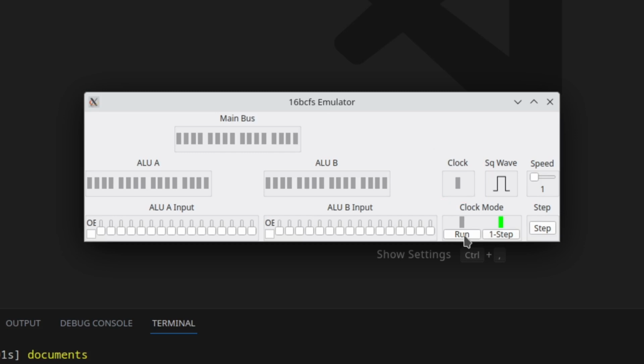And so what I'm going to do is create a 74LS or HC74 IC, and that has two latches on it. I need to latch both the run condition, so this LED here, and the single step condition, or this LED here. Now this is implemented as an SR latch, and so I will effectively turn this into a 1-bit register by putting a D-type latch activated on this square wave, because it doesn't stop oscillating. Let me get the 74HC74 IC developed, and then we'll come back around and tie that latch into the clock so that I only get state changes on rising edges.